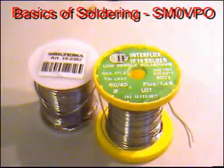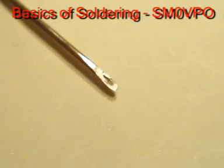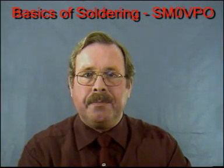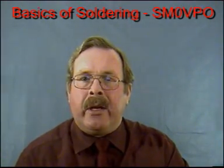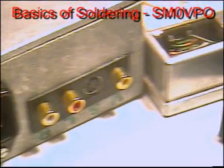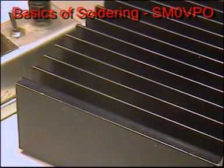Normal electrical solder is supplied on rolls as a wire and comes in various thicknesses. The wire has a capillary tube down the centre that contains a flux. Flux has a much lower melting point than solder, but it travels over the surface of the metals and prevents them oxidising when heated. Without flux, you would never be able to solder, because copper, brass and iron would combine with oxygen to form a barrier against solder. Unfortunately, we cannot solder to aluminium — aluminium needs expensive and specialised soldering equipment involving an inert gas atmosphere.